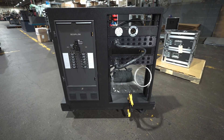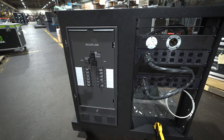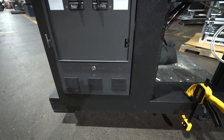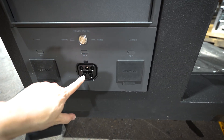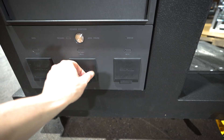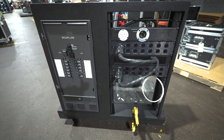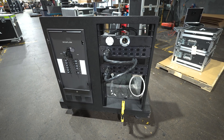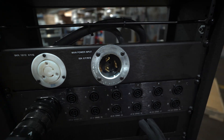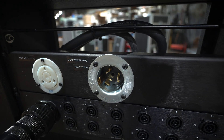This is a new one for me. The client specced the panel — it's a pretty interesting thing. It is a smart panel, which I have not played with yet, but it was pretty cool to do the config on this. It's designed for people with either electric cars or to use as a transfer switch so that if your house runs out of power, you can charge the EcoFlow brand batteries. They all plug into this, and this panel acts as a transfer switch. The way this client is using it is they'll run the floating set piece off of the batteries, and when it's time to charge everything, they can put it back on land power — which for this particular application is a 50-amp Cali connector. I feel like we've been getting requests for everything to be powered off a 50-amp Cali.